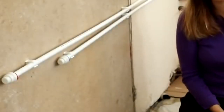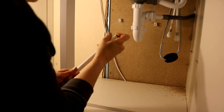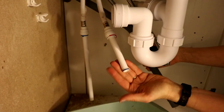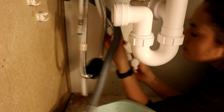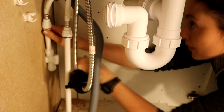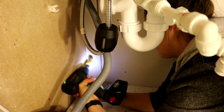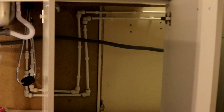The other issue was where I'd finished with the hot and cold tap in my very first plumbing video - it really wasn't low enough. So I had to work my way down from the sink and then back. I'm attaching pieces short enough to allow me to fit a couple more emergency shut-off valves. These are so useful - if there's a leak I can just turn it off immediately. I'm not going to show you the whole ins and outs, so I'll leave a link below. Then I had to create some holes at the back so I could get them to return to the water access, and used more speedfit pipe to meet the original pipes.